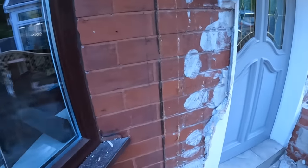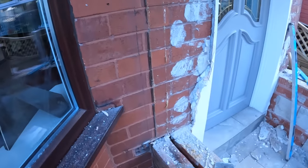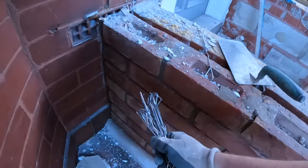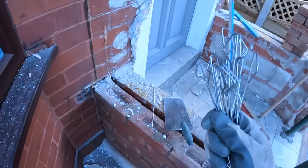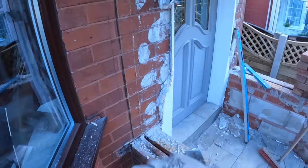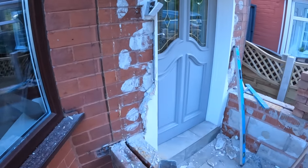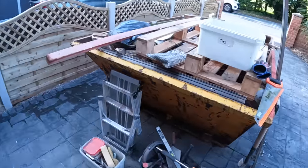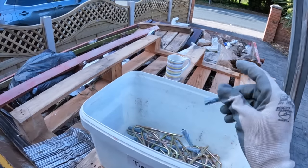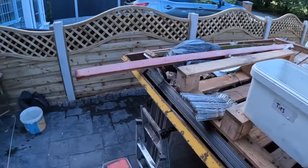Right, so as I said before, I've marked up where the bricks and blocks will be going. We're gonna be putting tie wires on every course, because it's only gonna be brick and a half pillar, so they're going in all of them. And we're going to have, I think, 4 screw ties in total on each side. Maybe, we'll see how it goes, but we'll have our screw ties, which are 10mm plugs. That's why we need the 10mm bit. All we've got now are 8 mils. So anyway,